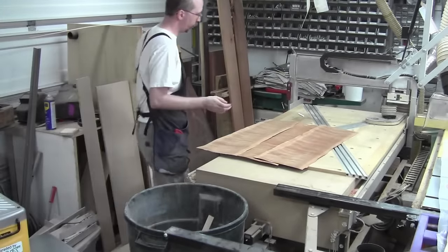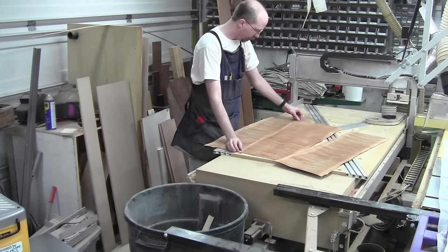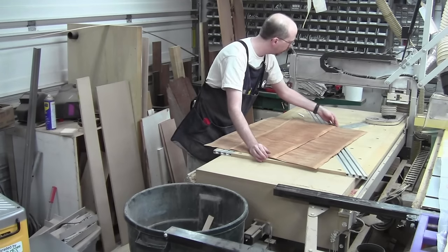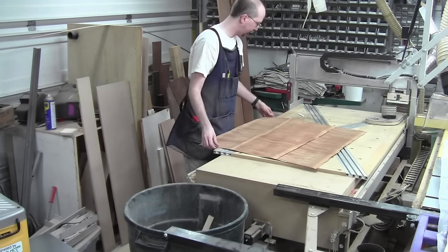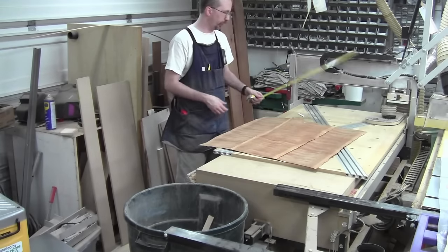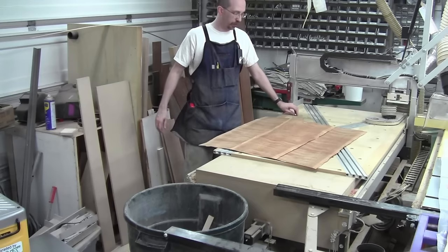Okay, so if I can, let's just assume I eliminate all of the sapwood, right? Let's say there to there, and then here do the same to about, let's say there. Like so. How wide do I end up with? Should be over 25. 28. We got plenty. Okay, so this method will work. I like it. I like this method a lot because it's going to give me the widest panel and the prettiest grain, and I'm not going to lose anything.